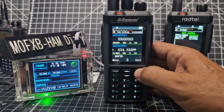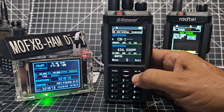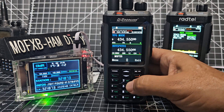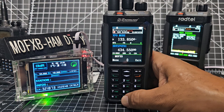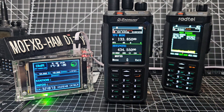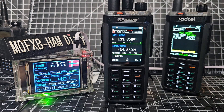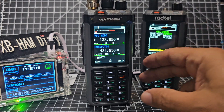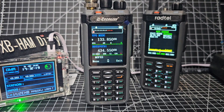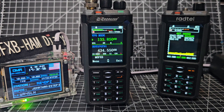Let's try Airband. We have to go into VFO mode — frequency mode, same thing. One three three eight five zero zero — get all the zeros in. I'll just connect my external antenna to make sure we can pick up AM. It's automatically gone to AM. I just heard it come through — wasn't clear, let's give it a chance. A bit distorted I would say.